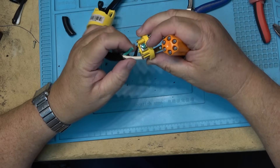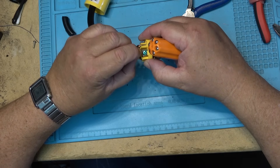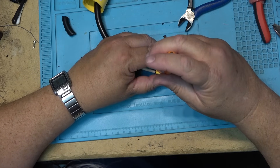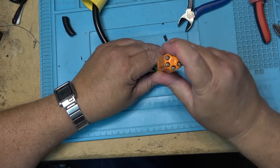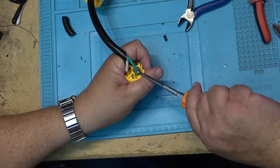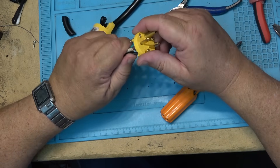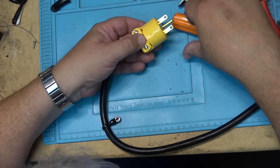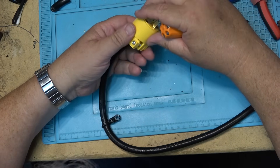We want the best possible connection, and the same for the ground lug. I've got a couple of shiners on the ground wire — I'm not too worried about that since the ground won't be passing any current unless there's a catastrophic failure. We'll put the strain-relief clamp on and get this tightened down, get the plug nice and safe, and then I can put it back in service and get my car charged up ready for work tomorrow.